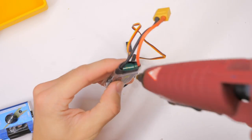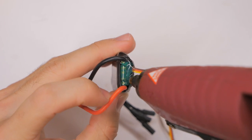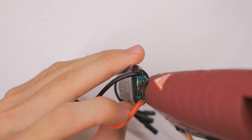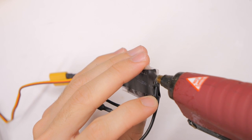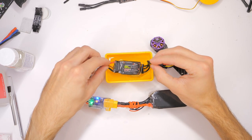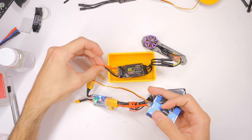So I thought, let's give that a try. I got another ESC with the heat shrink still on and fired up the old glue gun. I happen to be using Gorilla brand glue sticks, but I don't know if that actually matters. All I had to do was pump some good old-fashioned hot glue into both ends of the tubing — and voila! Completely waterproof ESC. How cool is that?